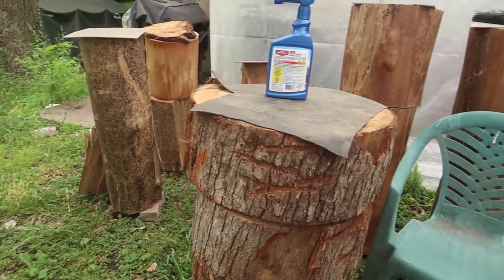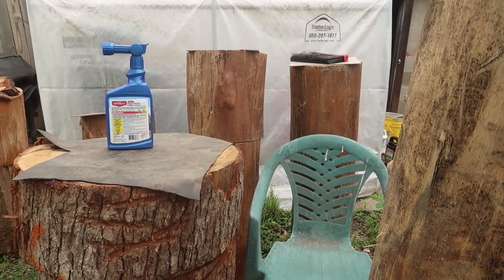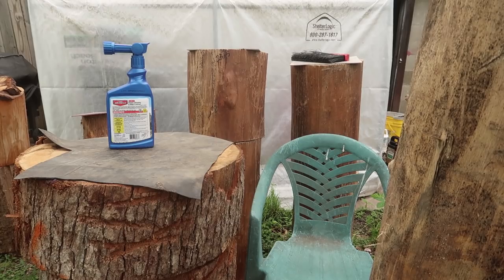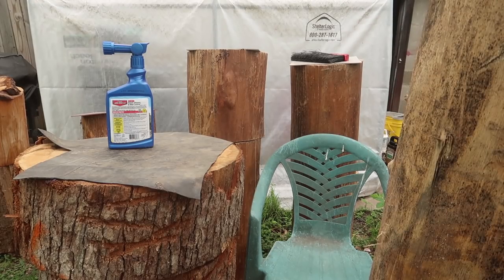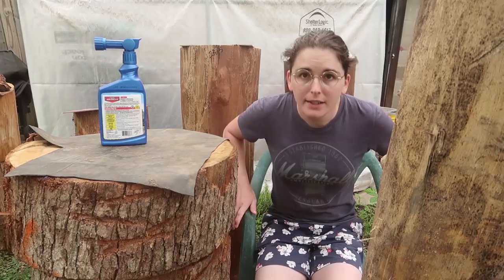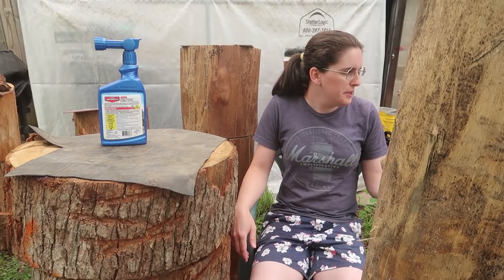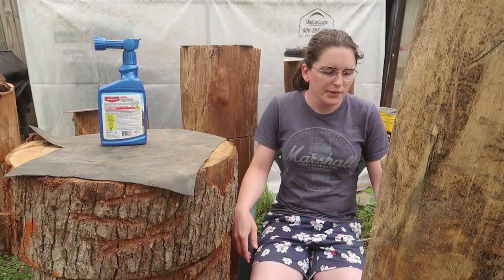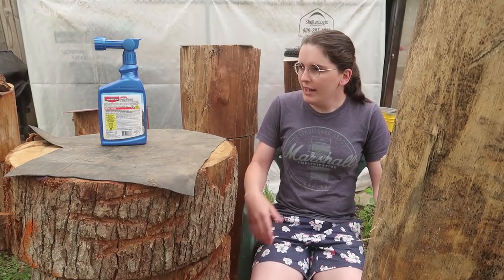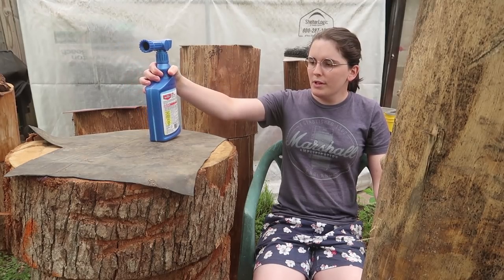Now they are splitting because my drying experiments were interrupted, but for what I'm doing, split lumber is perfectly fine by me. My mallets that I'm going to be making out of them, I'm going to be wrapping them with steel bands anyway, so whatever. So in conclusion, heating them up to 136 degrees on the outside, 104 degrees on the inside of the log, seemed to do fine. And then with this pesticide, I came outside 12 hours after spraying this onto all the logs.